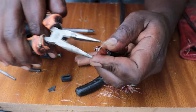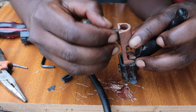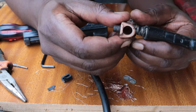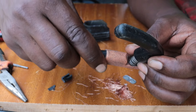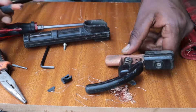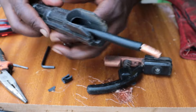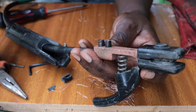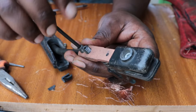Compact further the tip so that it enters that front part. Remember to loosen the screws completely so that we have enough space for the cable. Notice the handle is not there, so push the cable through the handle out of the other side and into that part, and then tighten those hex screws back into place.